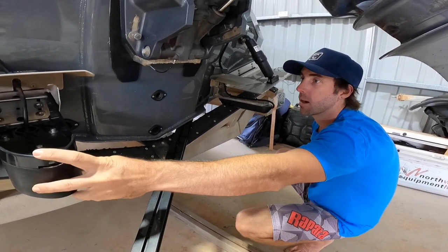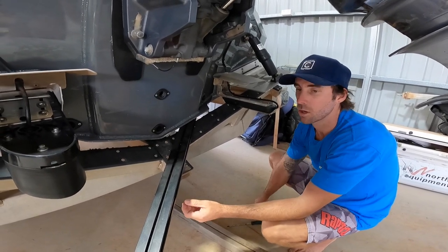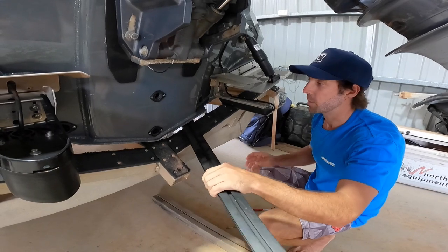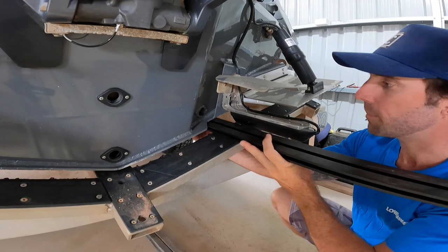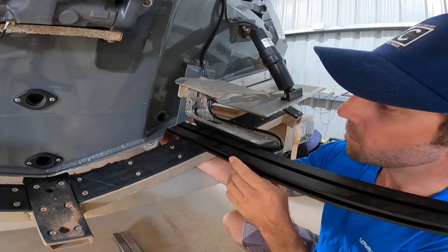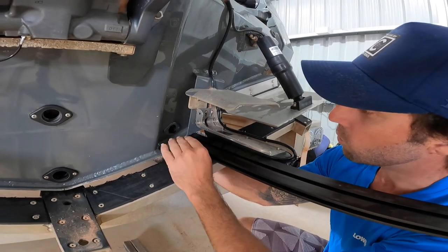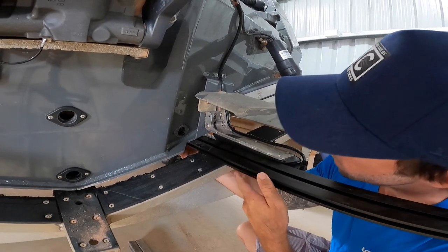The transducers are a little bit loose on the back. We're just going to do a little video here — I thought I'd take the time to show you a bit of placement so that you get the most out of it, so that when you're running it reads at speed. The first thing you'll need is a nice straight edge. Here I've got a little piece of metal — I've got about 800mm poking up along the bottom of the boat. This is so that you get a proper straight edge, so when you're running you want your clean water to come out. This nice straight edge is like this.